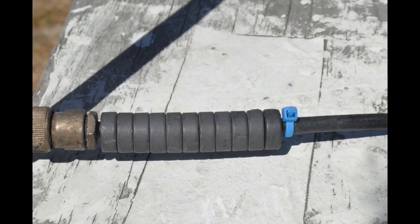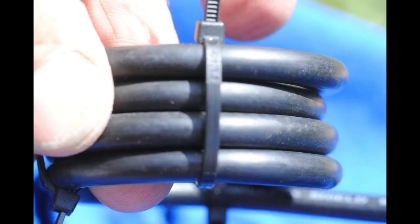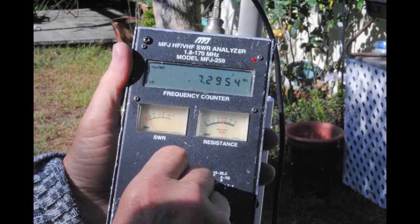It did. And what we always encourage is be sure and watch the RF eddy currents that can creep down the feed line, right, Jim? That's right. And that's the reason why I have my loop on the bottom. You don't have to do that because it's below. And that's one advantage of having the loop on the bottom versus the top. So you're not going to need a whole handful of chokes to try and get rid of that. In fact, the Amidon Mix 43 or Amidon Mix 61 with a mu of 850 allows that RF to stop right at the chokes, and even a little wrap like that will help. But this is what we do to keep any eddy currents from transferring over to the loop.